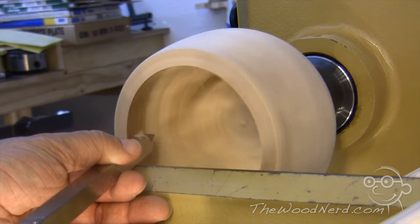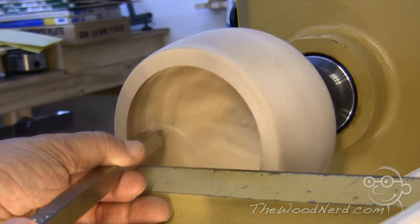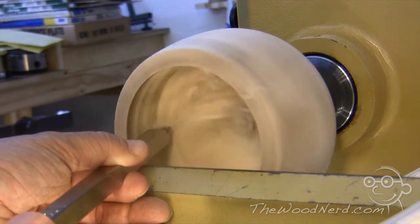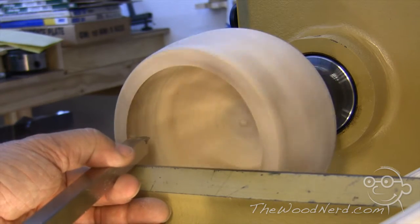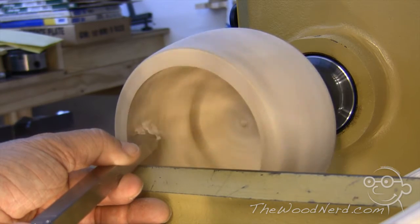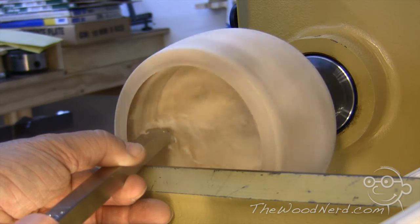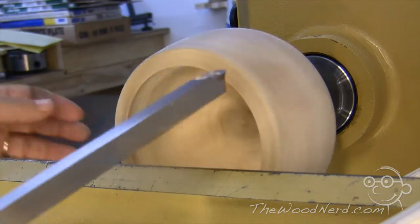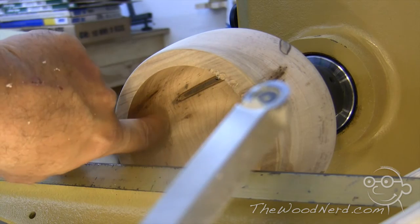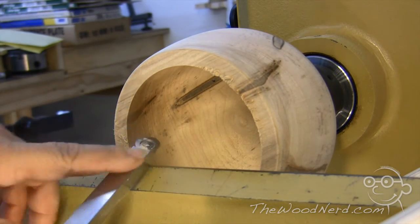As you can see here, it's just a demonstration. Even though I've been using it for roughing, when I start approaching the final thickness that I want — and this isn't the final thickness — the Easy Finisher now changes into a very delicate cutting tool. I'm getting a pretty smooth finish there with the same tool I was using for making heavy, rough cuts.